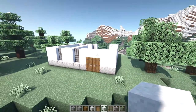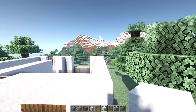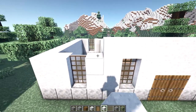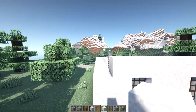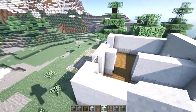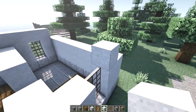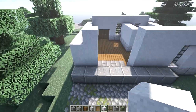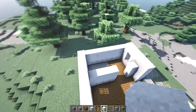Our next layer will be a little bit different. We're going to skip this side wall because we'll have a beam instead, go across the front side, and skip this side wall as well. We'll build up the back side one more block but again skip those two sides and leave those inside walls how they are.